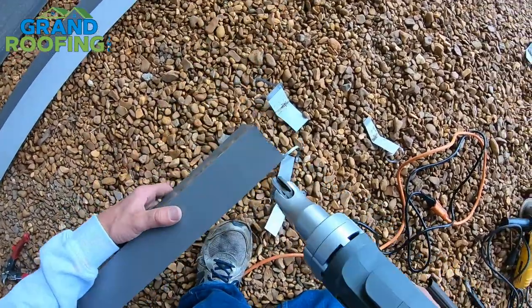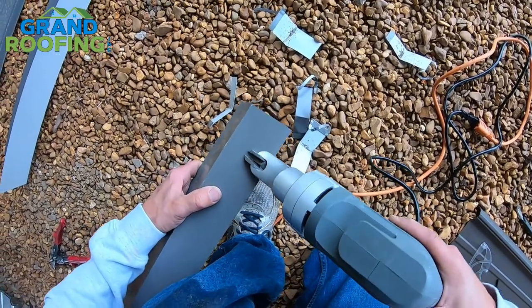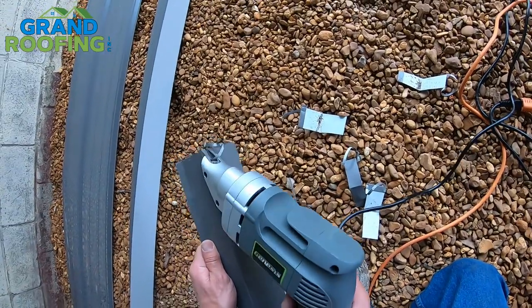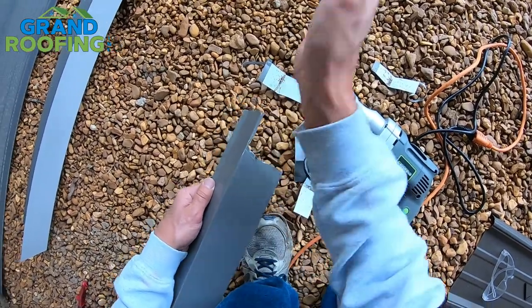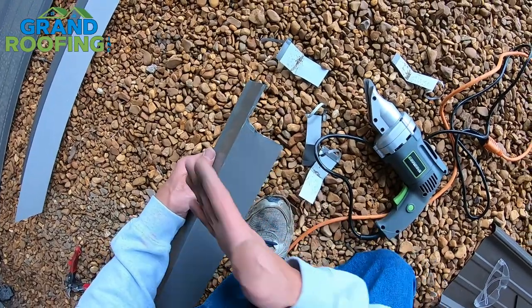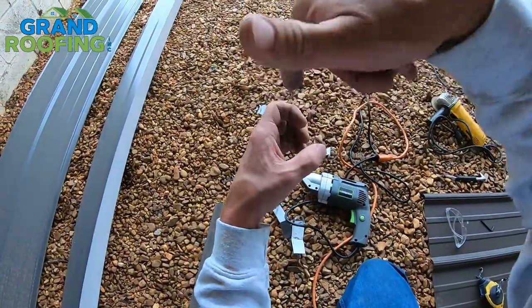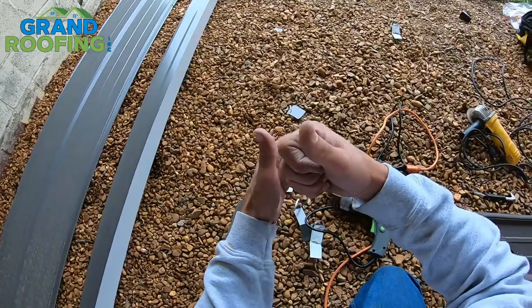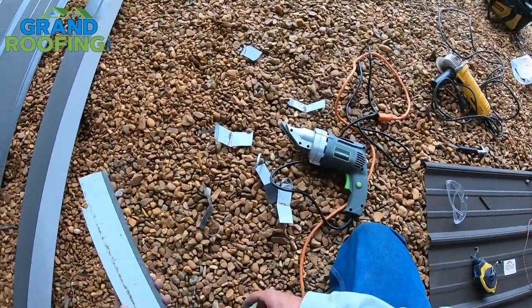Let's see how tight a turn it can do. It doesn't turn very well — you can get to an area and bend your wrist to change direction, but it's not good at cutting around tight curves. A nibbler is a different tool that uses a die and piston to punch out overlapping holes, letting you turn any direction. Maybe if I get enough likes I'll buy one and do a review.